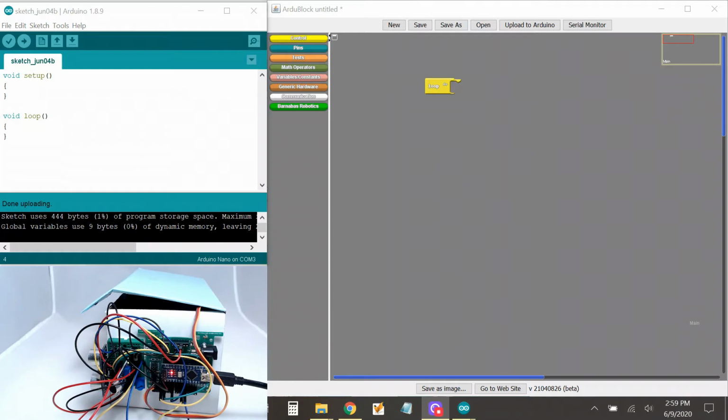All right, so now let's play a little bit with this sound sensor. Before we start, let's remember where we plugged in the sound sensor. The middle pin was ground, GND. It was one of the outer pins, the output, that was connected to pin 10. So remember that, we have to look at pin 10 when we're dealing with the sensor. I first want to make sure that my noggin is able to read information from the sensor.